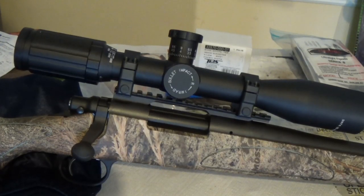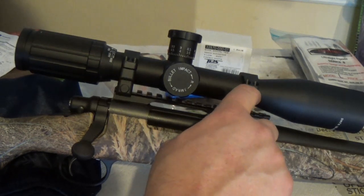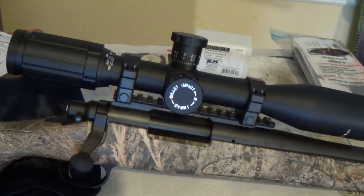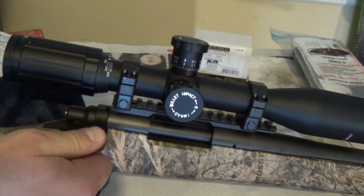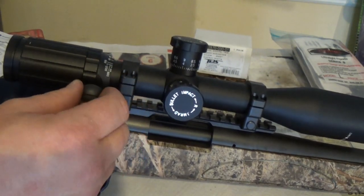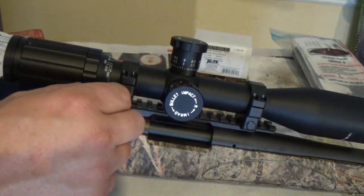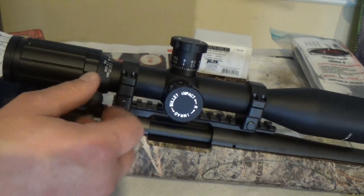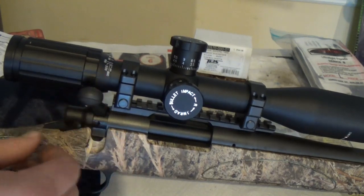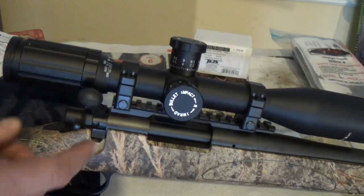One other quick thing that's very important — I already checked this off camera when lining up the reticle. You can see the twenty-one thousandths of an inch gap right there. You want to check bolt clearance. It's pretty good — really happy with that. Eventually another upgrade will be a better bolt handle, but this is good for now. That's good clearance right there. Thanks for watching folks.